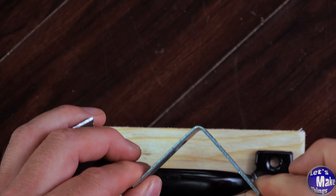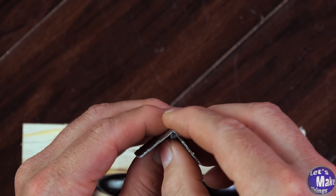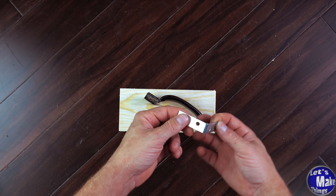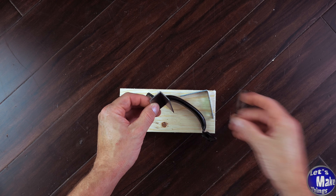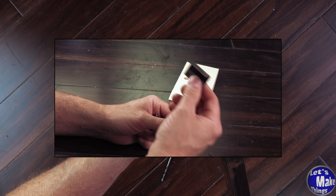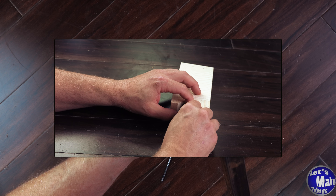I originally was just going to use a bracket, but I found that a lot of these brackets are rounded in the corner. But if we look at the square tubing, you can see that I've got a nice 90-degree angle, and this is exactly what I want to make sure I've got placed right in the center. If you don't plan on doing anything below maybe 3/16ths of an inch, then using a bracket like this would be okay. But anything below 3/16ths of an inch — like this 1/8-inch drill bit — I think you're going to want to use some kind of square tubing. You really only need two pieces of steel pressed up against each other to get that 90-degree angle.